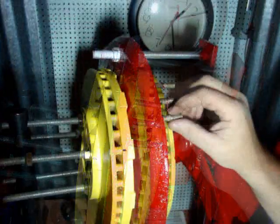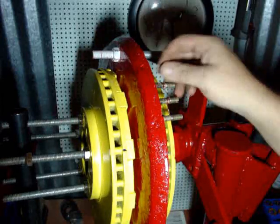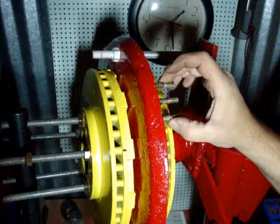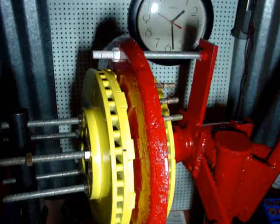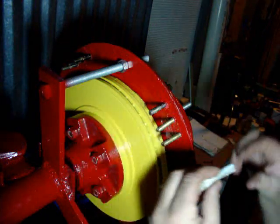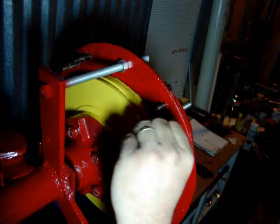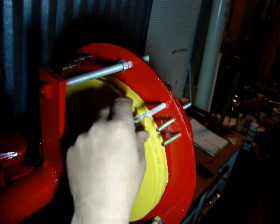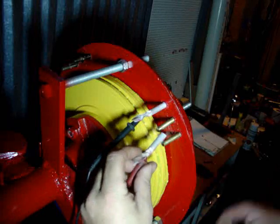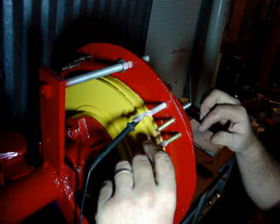I've got all these cleaned and I've got some wire wrapped around this — just some small thin stuff. If it pops it'll let me know how much that wire can take. We've got these all connected up here. You remember when I painted the stator we used that aluminum foil tape with the aluminum on the inside so it didn't stick, making little sleeves pinched shut. I found a real good use for them — you poke your leads right through them and they hit aluminum all the way through.